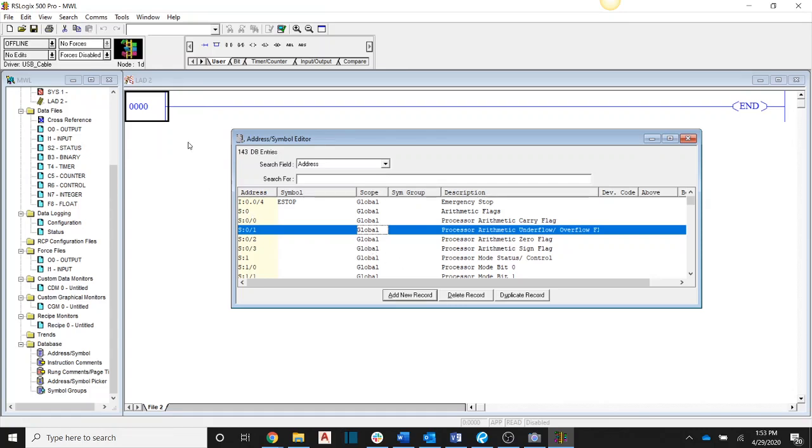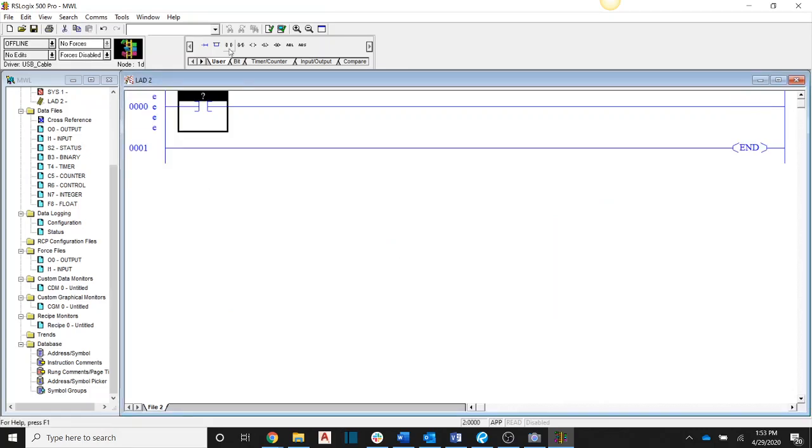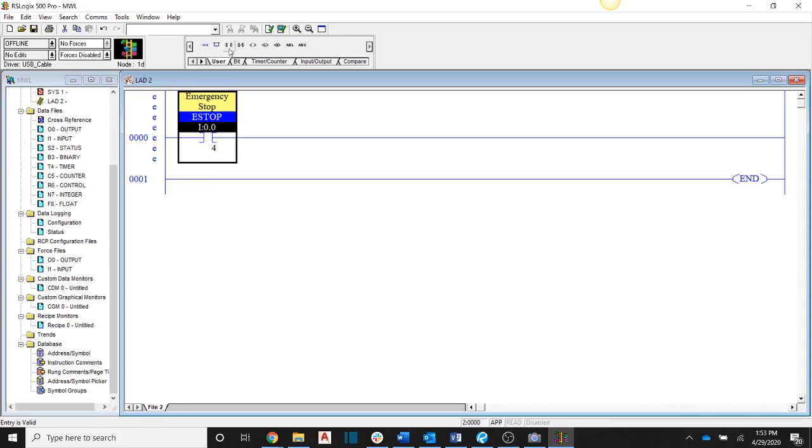Okay, and then we want to tie this to the e-stop. And we're used to, with all the other shop jobs, the e-stop being a certain address. And if you notice when I do my videos, I type in the address specifically. But you don't have to. You could just type in the word e-stop, and it'll bring in the I/O address. So once you get your I/O addresses set up properly, you will be able to use the symbol name for each one of those. And it'll save you from having to continue to reference back to your sheet to get the assignment so you can punch in the address when you're coding.